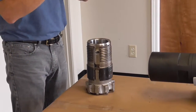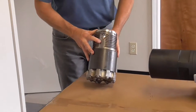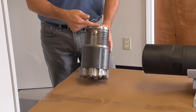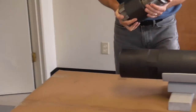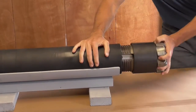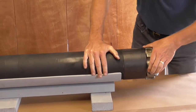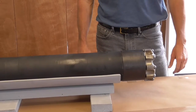Put that together, take your chuck sleeve, slide it on down, and there you have it — that's your chuck assembly. There is a retaining wire in the lower end of the casing that the groove on the top of the bearing will shoulder up against to keep everything tight. Additionally, once this whole assembly is put back in the hammer, the pressure exerted from the threads by the casing will actually grip the bearing and hold everything in place. So there's servicing the bit and taking the chuck assembly apart.